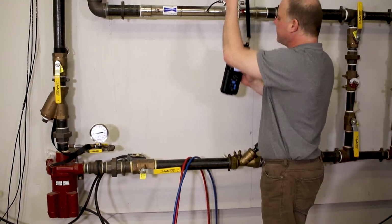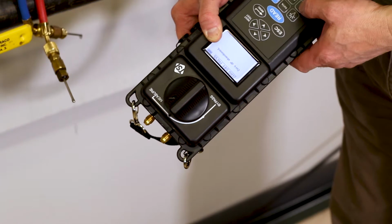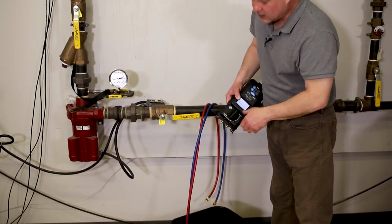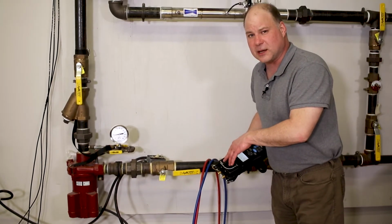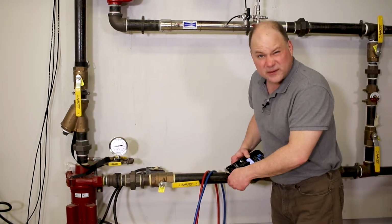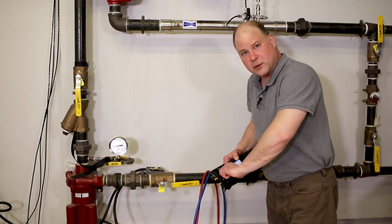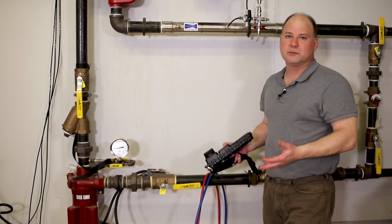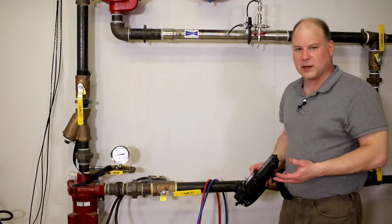For the instrument itself, all you really need to do is tip it forward, maybe move the valve handle back and forth a couple times. If you have any concern that there may have inadvertently got any debris inside the ports here, you can easily take some compressed air, 5, 10, 15 PSI, put it on one of the ports and work it through by adjusting the knob. At this point, you're ready to put your instrument away, pack it up, and get ready for the next day.